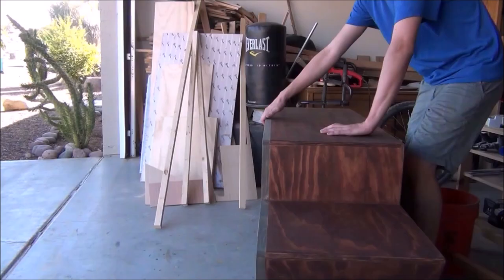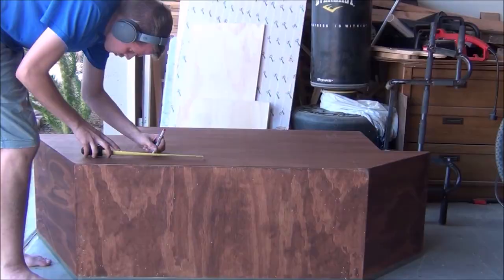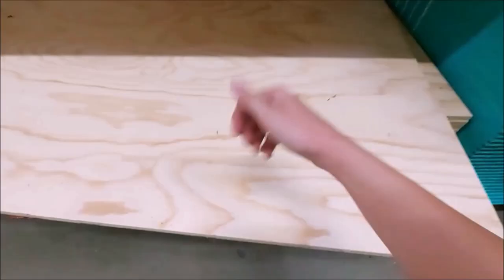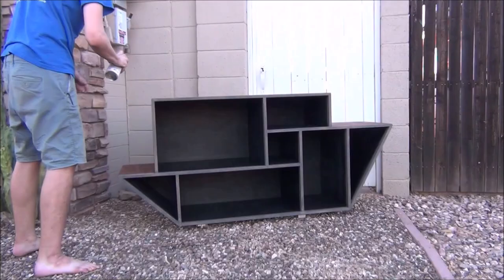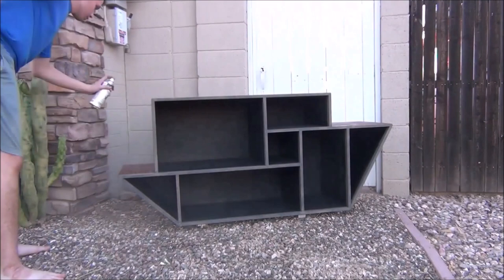I just realized I forgot to cut a hole for the power wires to go through, so let's do that. I'll just mark where I want it, drill some pilot holes, cut it out with a jigsaw, and Bob's your uncle. You'll have to lightly sand the edges and do a little bit of touch-up staining, but that's it. Lastly, I'm just going to go ahead and seal everything with some aerosol sealer from Home Depot — I'll leave a link below. I really like the aerosol stuff because it's a lot harder for it to run, bubble up, or drip, and it gets in all the little crevices, which is super nice.